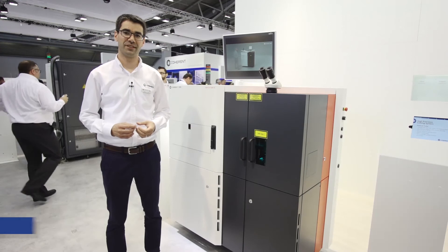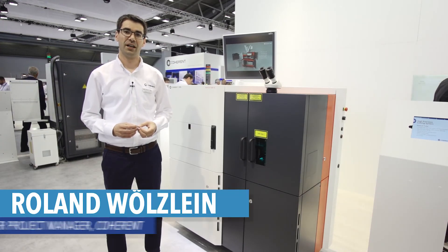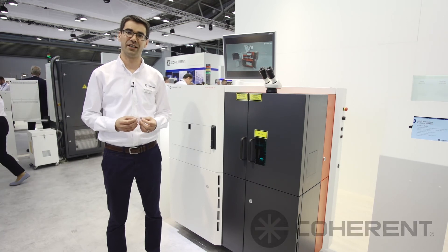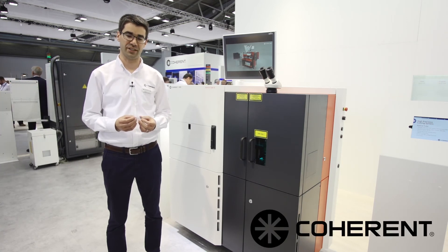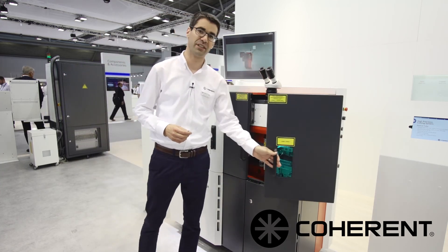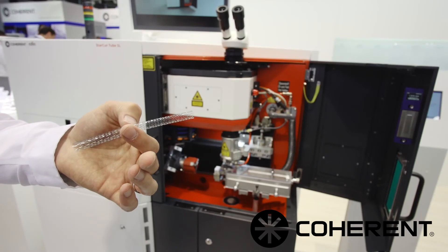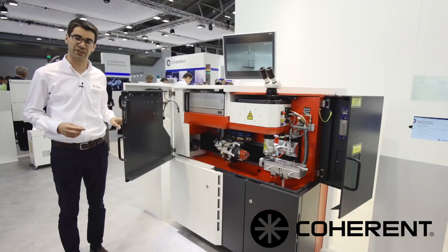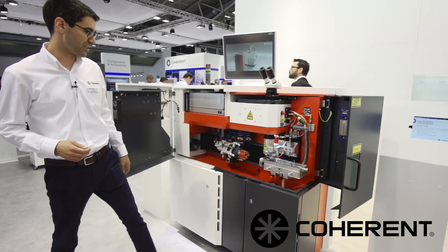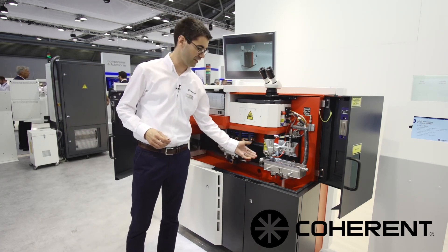Hello, my name is Roland Welslein and I'm the customer project manager of the Starca Tube family. What I want to show you here is a stand which we produce with the Starca Tube SL. On the machine we have perfect accessibility to the system — we can open the full side doors and have full accessibility to the rotary stage, which is needed to hold the part and move it to the cutting head.